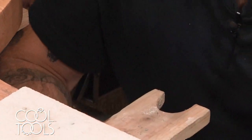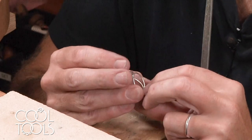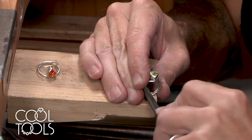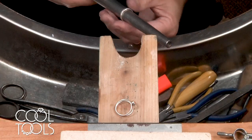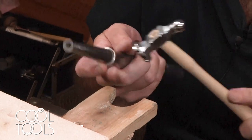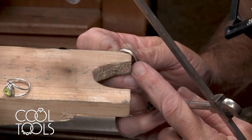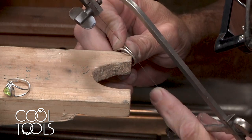As far as cleanup goes, I like to use a half-round file to clean up the excess material, especially on the ring we sized up — there's a bigger chunk of metal on the bottom, so I'm going to clean out the inside first, and tap lightly on the bottom of the ring, just making sure that it's true and round. I like to use the saw to make a separation line between the two bands at the bottom, and just score a line down there.